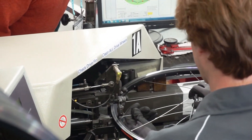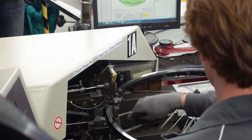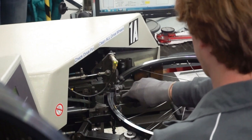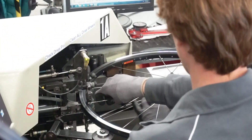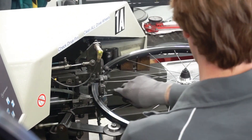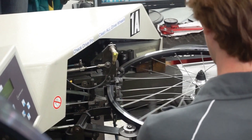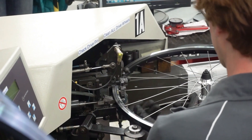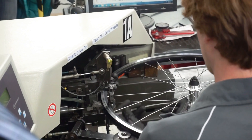Another thing you're going to see is the wheel press here. Before, we were using the stabilizer machine, and that was actually causing more of a cycle time — it was at 180 to 200 seconds. Chad realized that if we were to do it manually, that's going to reduce our cycle time significantly. Now our cycle time is anywhere from 130 to 150 seconds, just by manually doing the press here rather than inside the truing robot itself.